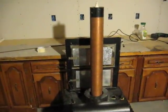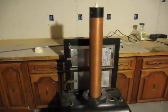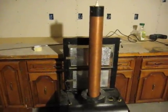This is the Tesla coil that my brother and I built when we were 13 years old, some 43 years ago. It's constructed of a neon sign transformer — I don't know if you can see it here — that is 7,500 volt, 30 milliamp.